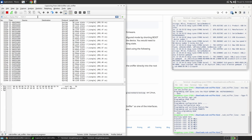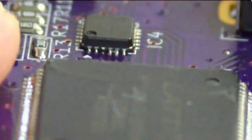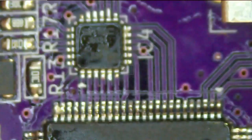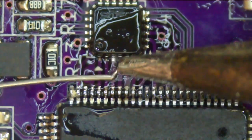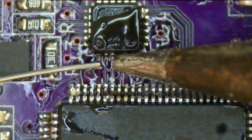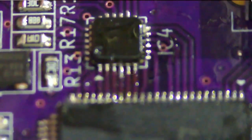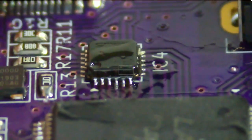I was a little puzzled because the first build had worked correctly. So I went back and looked at the board — you may remember that I screwed up that one pin that looked funny compared to the others, third from the left. Looking at it from that angle, you can see it's not making good solder contact, and there may even be a small short on the two pins next to it. All I need to do is a little more drag soldering to really make sure I've got a good connection on all these pins. Plenty of flux, recheck it, and that's looking a lot better. Definitely making a connection now.